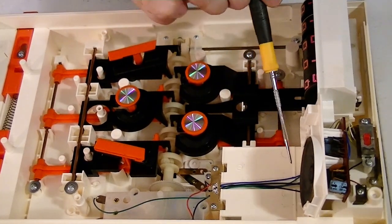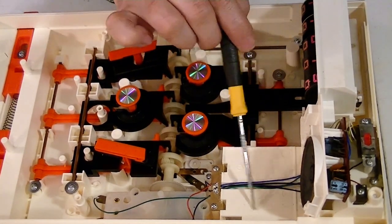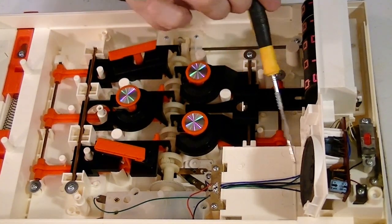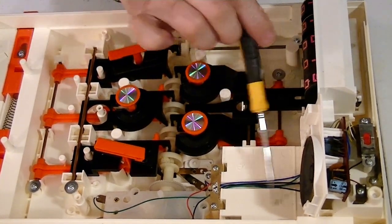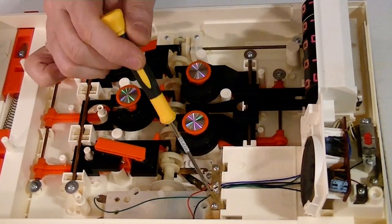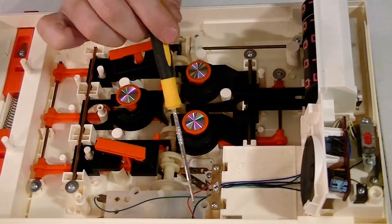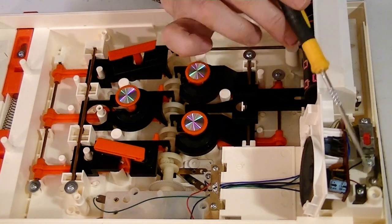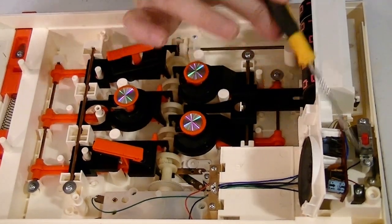These other 4 batteries down here are run in partial series and partial parallel. There are 2 in series, and then those 2 are in parallel. So we have 3 volts from the series batteries, and then those are run in parallel to create the double of the amp hours. So still have 3 volts, but we have a longer amp hours of the battery. The switch is double throw, and it works both the sound and this side of the batteries. And both of those systems are pretty much separate.